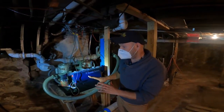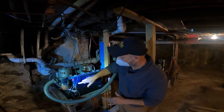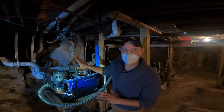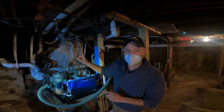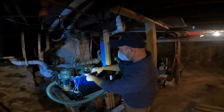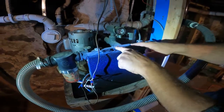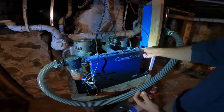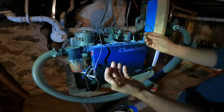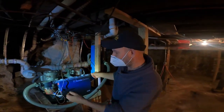In order to troubleshoot this, the quickest thing I can do to restore operation is attempt to remove the switch out of the equation. Typically things break where people touch them, and I know that switch gets touched every day. The method we're going to take is we're going to whip power off here, because when we try to turn it on, it does not activate. I did check both of the fuses — fuses are visually good. We can even take a measurement on them, but I've already done that and I know the fuses are good.